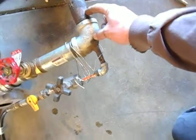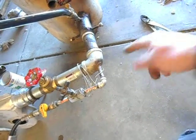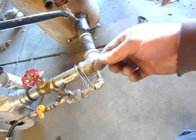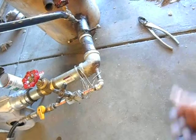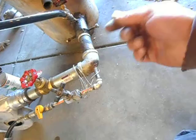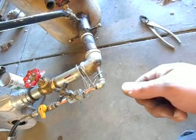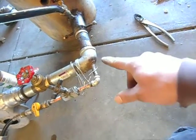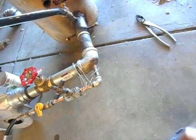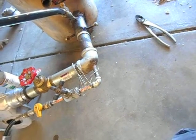The end of this nipple sticks out to about here. For an orifice, I cut the threads off the end of the nipple before I welded it on, and then tapped the inside of the pipe to accept a five-sixteenths bolt that has a hole drilled through the middle of it. So it makes it a removable orifice so that you can go a larger or smaller size if you want to. That's the propane setup and it works really good — I have melted copper with it, and here pretty soon I'm going to try melting some iron.